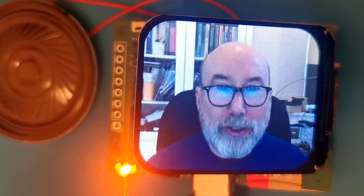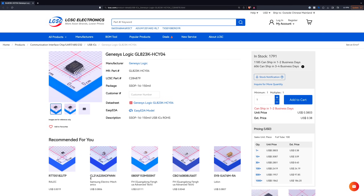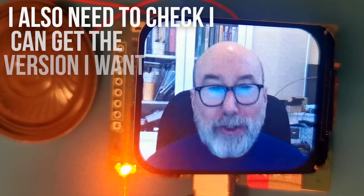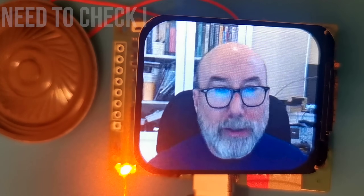I'm also looking at a much cheaper IC for the SD card controller. There's a GL823 that is just 40 cents - that's 10 times cheaper than the USB 2244 - and it doesn't need a crystal, which simplifies the circuit and reduces the BOM nicely. The docs for this IC are not great, so I'm going to create a test PCB first to see if it actually works.